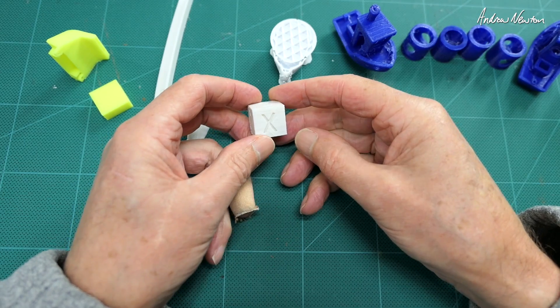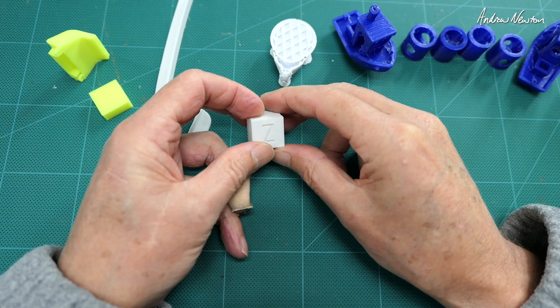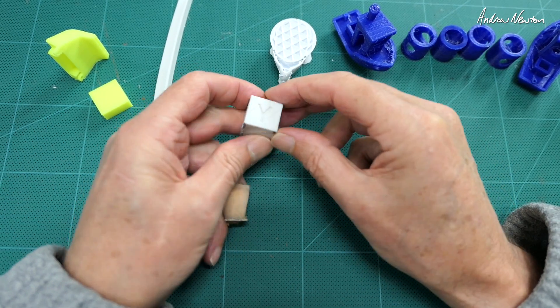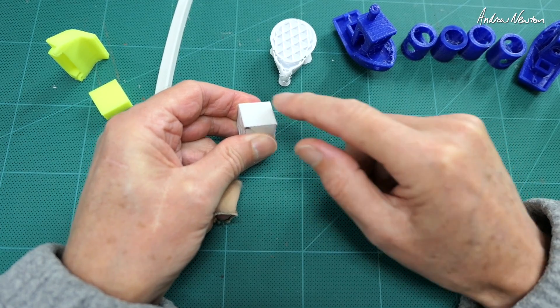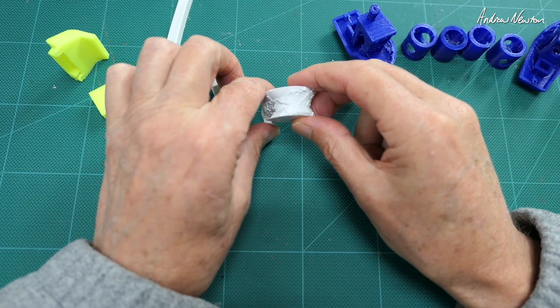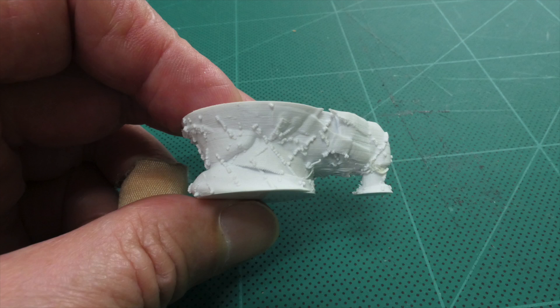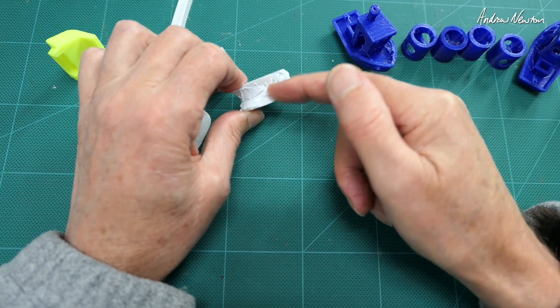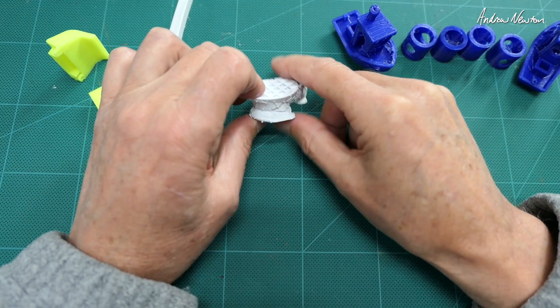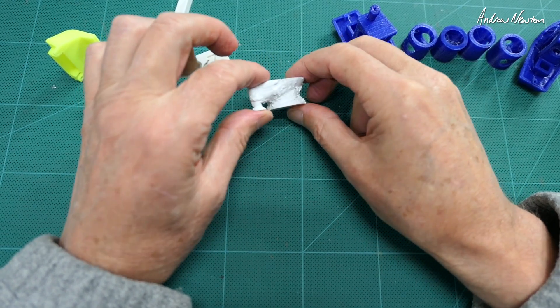Next I printed another calibration cube using the ET4 profile provided in Cura and it was a bit disappointing — I've got these diagonal lines coming across the surface. I also wanted to print a little pilot head for a Macchi jet model and you wouldn't be very happy with that result either. Those are actually infill lines extending through to the outside — the infill lines that fill up the internal space for strength were extending through to the outer surface.